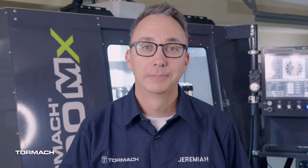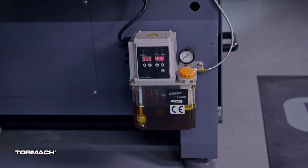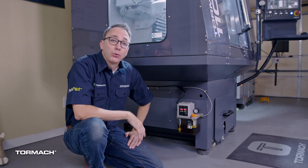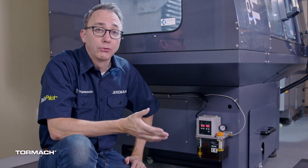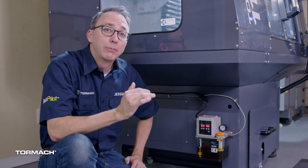So it's up and running. Let's make sure it's properly lubricated. If you have an automatic oiler like this one, once you turn on the machine it's going to take care of that job for you — you're good. If your machine is equipped with a manual oiler, pull the plunger. If the machine has sat for an extended period like greater than three days, the oil in the lines may have drained to the reservoir. In this case, the plunger should be pulled several times to reprime the lines.